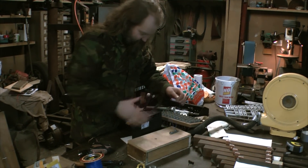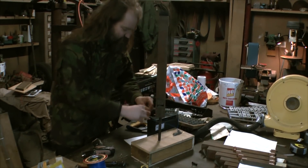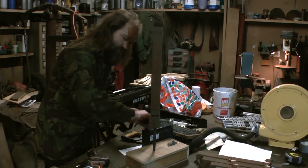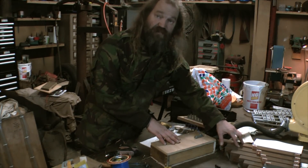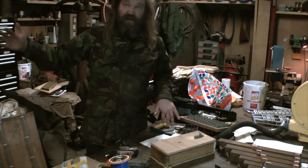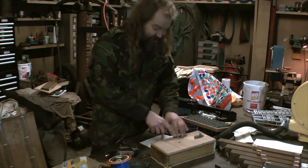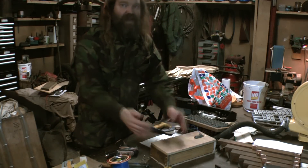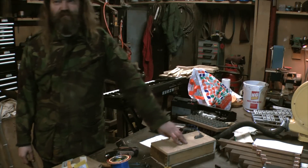We've got a style pneumatic chest. I'm hoping it's going to work — just plonking the hole — and I'll just see what the reaction time is like. None of this has been set up or regulated yet. So it worked. This really should form the basis of every other organ we make, because this is a simple two-stage pneumatic system which is fine for pipework of this size working on this sort of pressure. If we end up going for much bigger pipes, we may want to add a third stage, because we need to get more air into the pipes. That's dead easy — this second stage supplies air, we can have that inflating a bigger pneumatic motor, opening a bigger hole, and it's infinitely scalable. You could use this for anything from tiny pipes up to foghorns. That's the basic electric pneumatic system — it doesn't look like much, but it's a big leap forward.